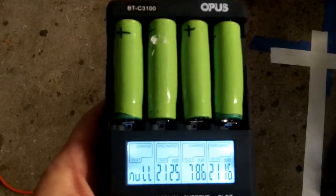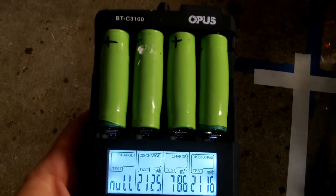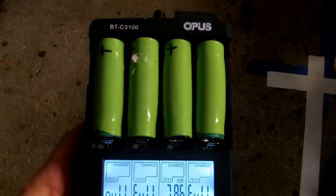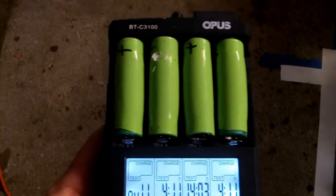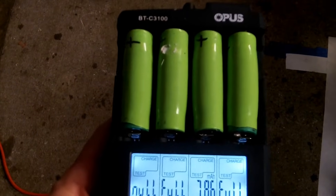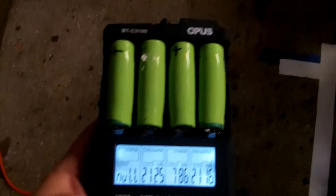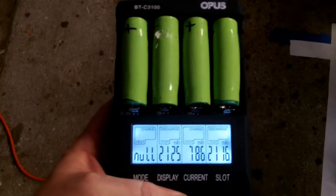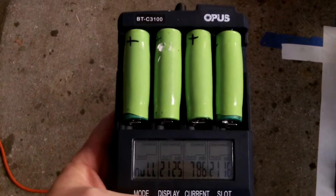One cell failed more than the rest. Of the four cells I tested, two successfully passed and are showing 2.1 amp hour capacities - so they were 2.5 amp hours originally and four or five years later are still at 2.1. The other two cells: one says null and the other hasn't finished the test, so two of these are not good enough to complete the test. I think all the cells on this battery were reaching their calendar lifetime age, and while some might still be okay, they're bulging. Several were definitely bad, so it's definitely the right choice to take this battery out of service.